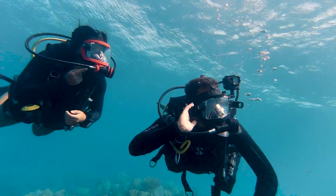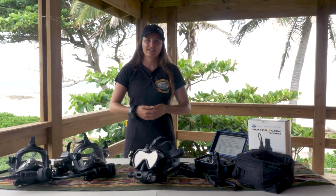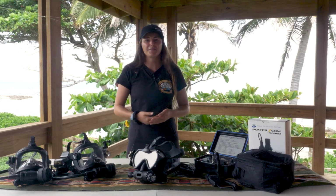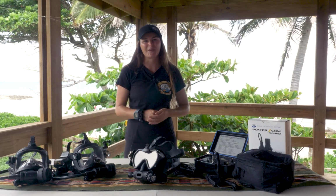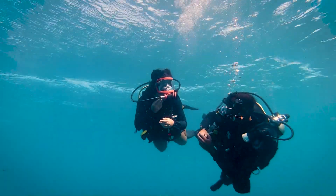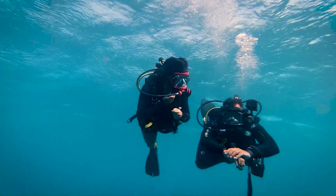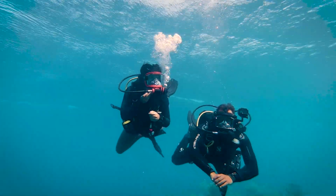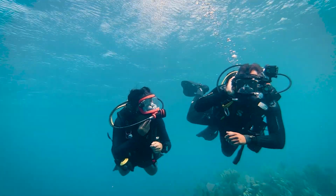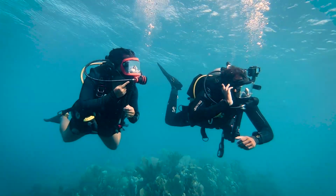Here are a few pointers. Speak clearly with authority into the microphone. It's a dynamic mic, energy in, energy out. Mumble in, mumble out, so no mumbling. Let your buddy know when you're calling. Hey, insert name of diver. When they reply, they will know to breathe slowly or hesitate breathing to be able to hear with minimal bubble noise. Keep communications short and to the point.